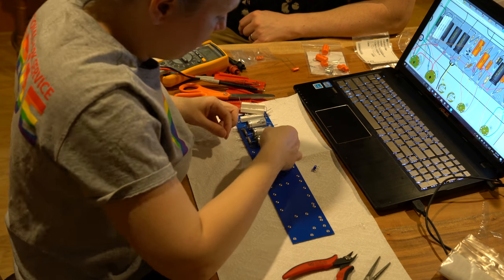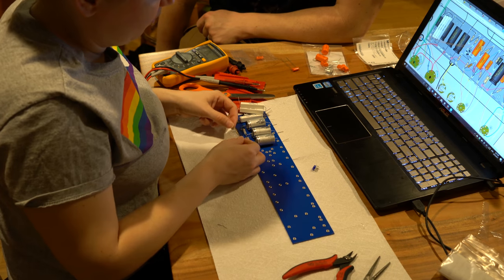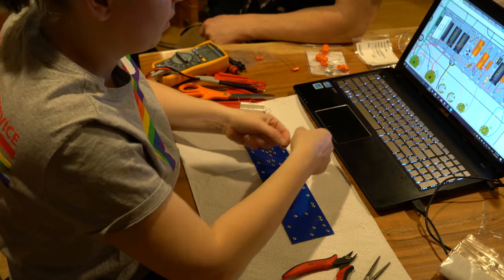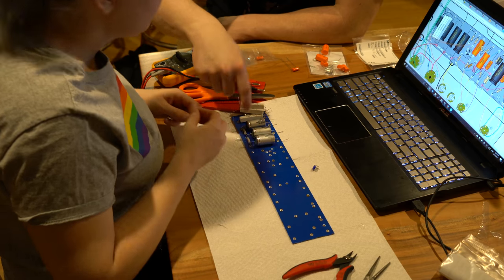You can do as low as a quarter watt quite often in amps and it won't be a problem. So we've got the gold this way, so I'm going to turn it as if it was going up. That should be fine. You can also imagine in your head that this is the top side, because this is where positive is, the high plus rail.